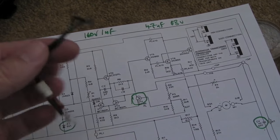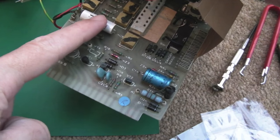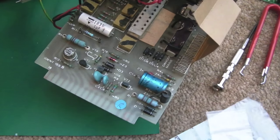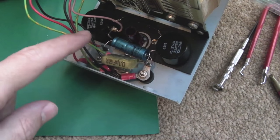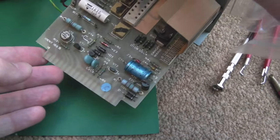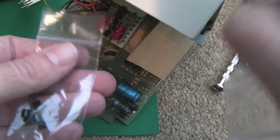I'll order all the parts now and report back once they've arrived. A few days later — I've swapped out the 1 microfarad cap, swapped out Zener Z3, and removed the transistor. I've got a 630 volt 100 nanofarad cap to put in. I still haven't got all the electrolytics yet, but I should be able to test without those for now. The unit's from the very early 80s — like 1981 or 1982. I've also got some new neon bulbs which look pretty much exactly the same size as the original.